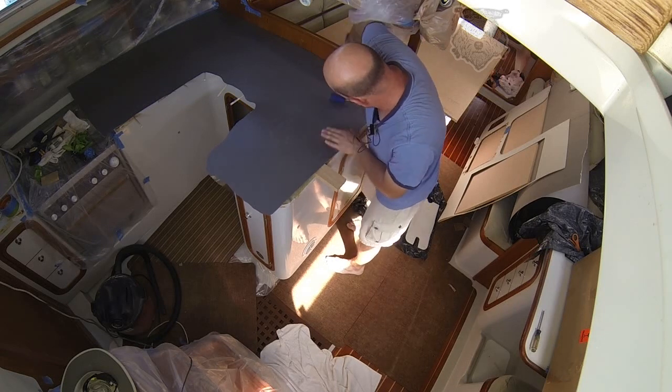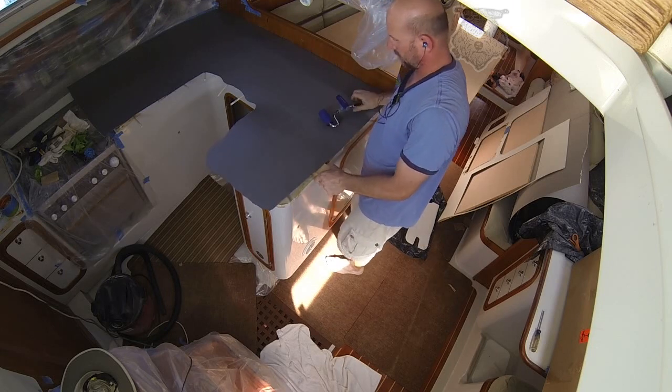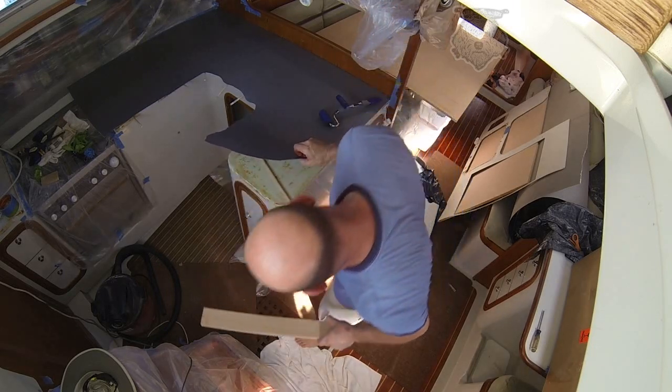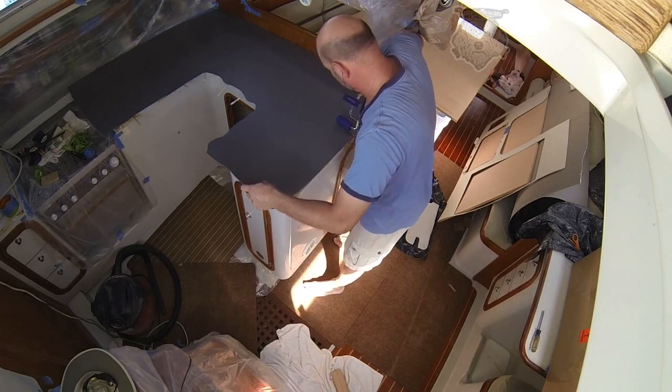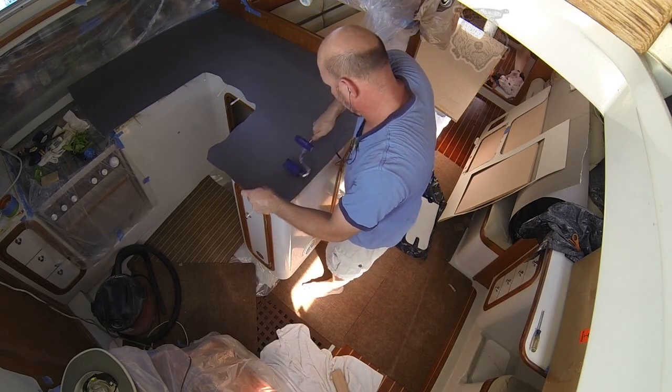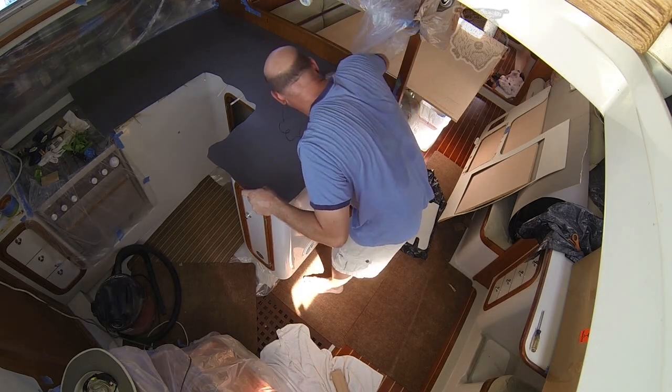Start to roll it out — this isn't my main rolling. Now on these rollers, over time they'll get a little bit squeaky. The best thing to do is just pull that roller tip off and then just grease it on the inside slightly, and it'll roll better than new. These things are awesome. I had to do that right after this, actually.